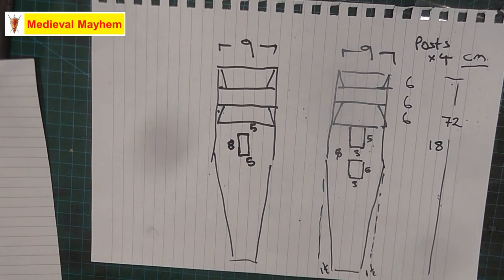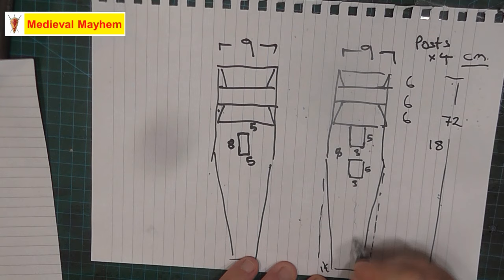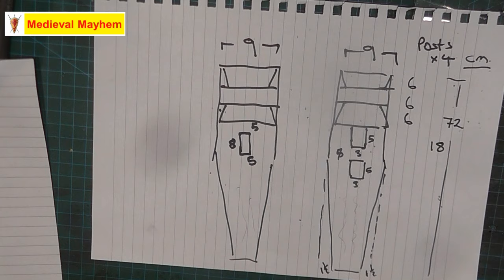Now, just quickly, I found this to be, it looks very simple on the surface, but it's actually nowhere near as simple as it sounds. There's a lot of detail work there, and it's because of the thickness of the posts, I found them quite difficult to work with. However, the challenge was definitely worthwhile. Now, the big problem that I had was creating these cuts here at the bottom to reduce the sides by the 1.5. So I tended to find that I had saw blade markings on these posts, and you can see that slightly if you look at the video.